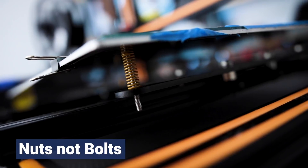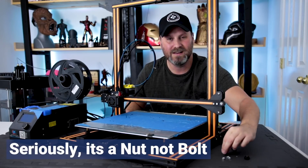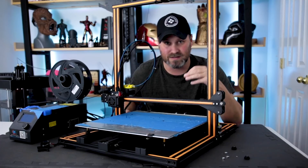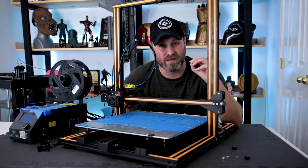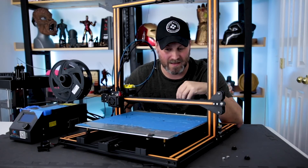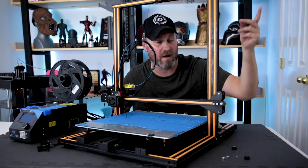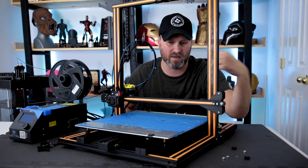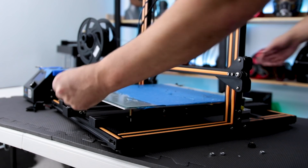To alleviate this, we're gonna stick one of these bolts in here, nesting below the screw. The spring is gonna sit on top of this bolt and give it a little bit more leverage. You could also purchase thicker bolts or double up on them if you needed that extra leverage. These are super cheap — you can get them for like seven cents, probably buy them in bulk. I also purchased these in a few smaller sizes because the Anycubic i3 Mega uses a slightly smaller thread than the CR-10 S4.